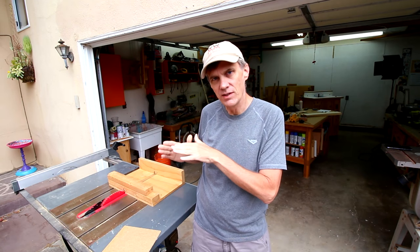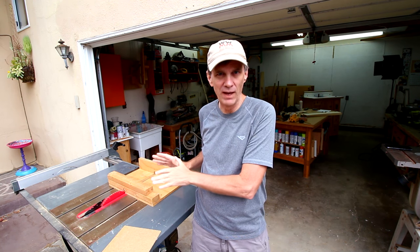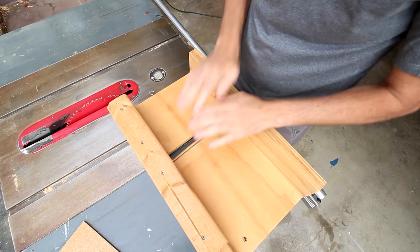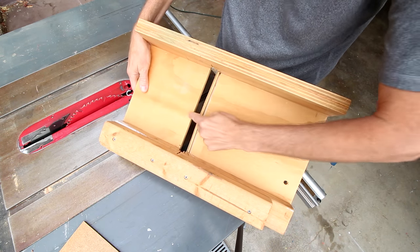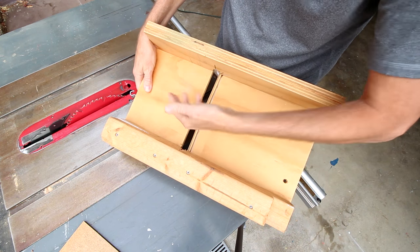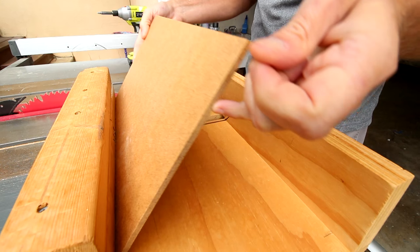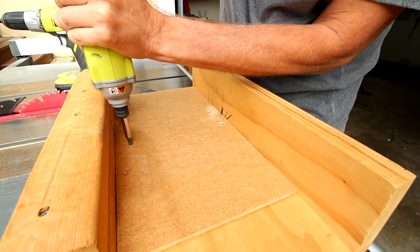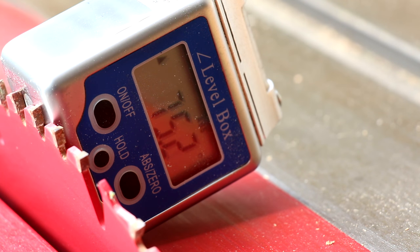The angle on each piece of a 12-sided shape is 15 degrees. I'm going to show you two different methods to make those bevels. The first one is using my table saw crosscut sled. This is my little sled that I use for different size bevels, but over time this throat has gotten really wide, so I'm going to make a quick zero clearance plate. I just got this piece of masonite or hardboard that'll set down in here. Since I'm going to be measuring the angle on the outside of my blade, I'll dial this into 75 degrees.